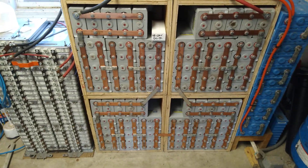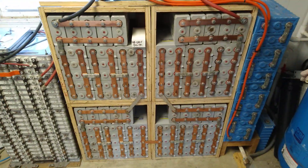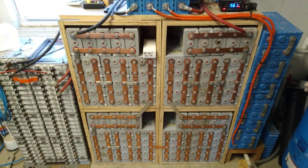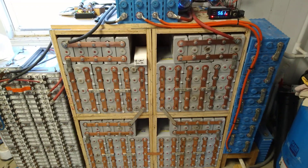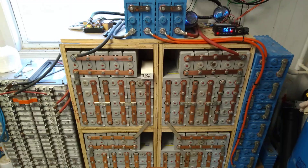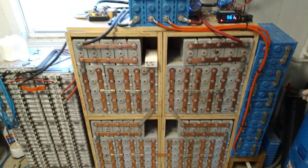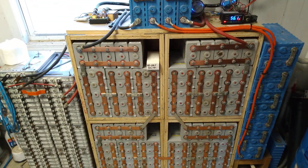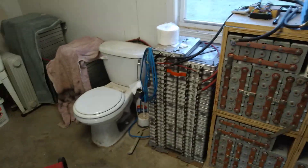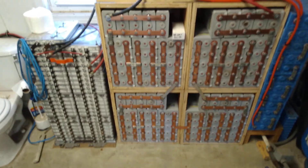Some of them just stayed at 3.3 or 3.4, and I did the same thing with the blue ones. It's really tedious — basically I was doing the job of a BMS, being a really inefficient and slow BMS. I've had comments from people saying they noticed I don't have a BMS, and my answer was, yeah, you're right. But I think I'm going to bend the knee — I've ordered a BMS, and if it's good, I'll probably order at least three more. They're like $100 or so, and if they are that good, I may end up using that same BMS for the Cub Cadet, because it's going to need one too.